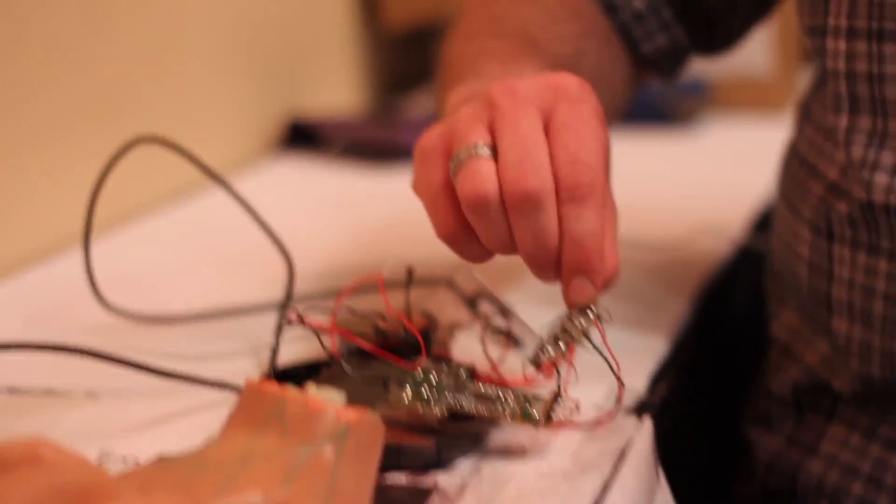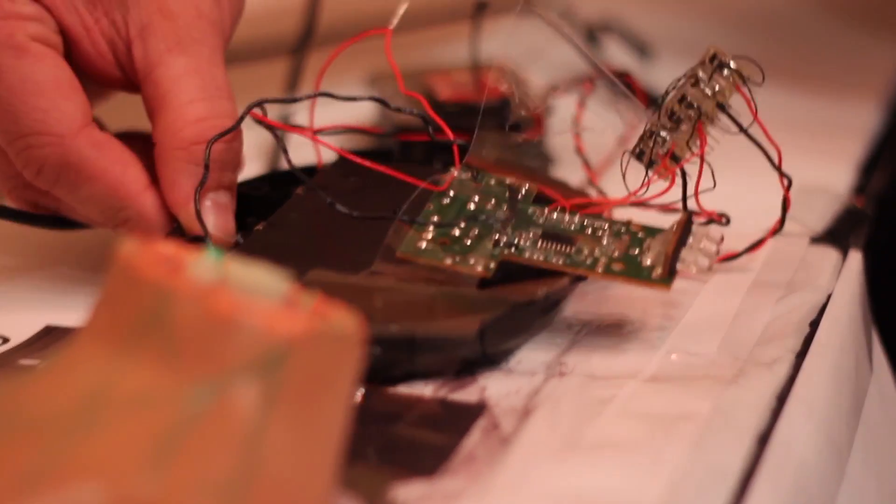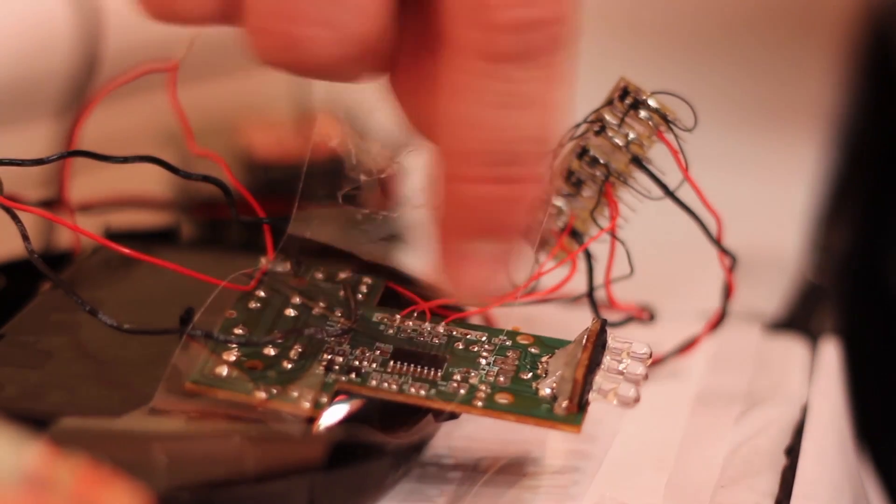Explain the Thing-based station. So here we have the K64 communicating via Wi-Fi through some tricky I/O and some hacked-together circuitry to talk to the Thing transmitter. That was probably the most tricky part — figuring out what this unmarked chip is and how to play with it, because it wasn't apparent when I first looked at it. We get commands over Wi-Fi, the K64 talks to the transmitter, and the transmitter goes over IR to the hand.